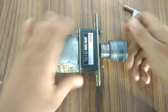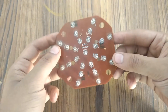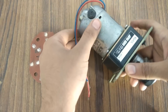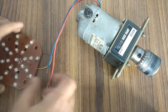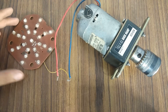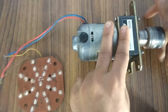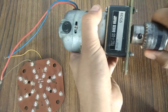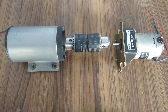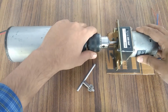What I am going to do is rotate the shaft of this generator at an RPM higher than its rated RPM. The RPM printed on its label is 4300, but because of the gearbox it is reduced to approximately 700. The gear ratio is 1 to 6, which means that if I rotate the generator's shaft one time, the motor will rotate 6 times. For this, as you can see, I am using an additional DC motor to rotate its shaft at an RPM higher than its rated.